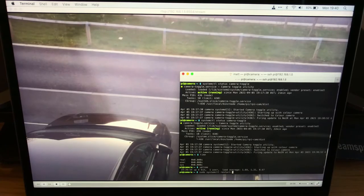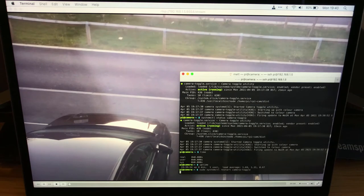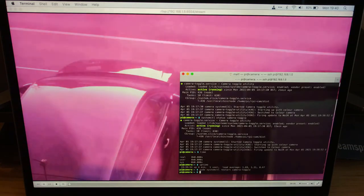There were also a couple more problems. The initial tests with the switching between the two cameras actually failed when transitioning from daytime to night. It turns out this was caused by a bug in my code, where I was trying to convert the next time that something was happening — i.e. sunset or sunrise — but failing to account for conversion to milliseconds correctly. This led to my update intervals taking a lot longer than they should have been. So I fixed that, and that started working.